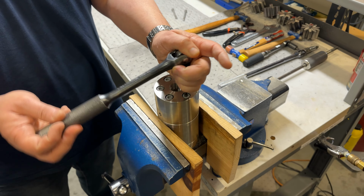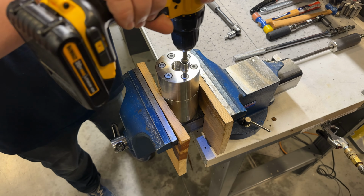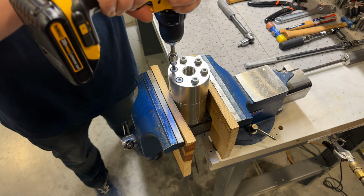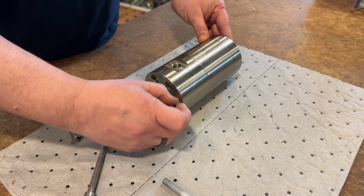Begin by loosening the bolts with the 6mm hex wrench. Be sure to have your meter in a secure vise. We recommend either putting wood or rags on both ends of the meter to avoid marking it up. Once the bolts are broken free, remove the meter from the vise and continue to extract the bolts.